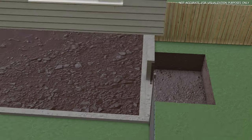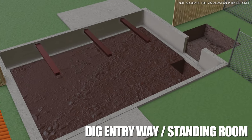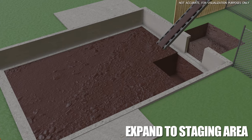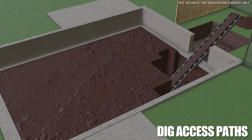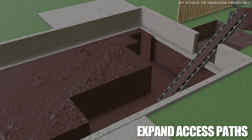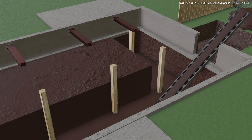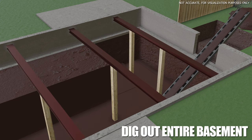Once that is done we're going to make our way inside. The beams are removed for visualization purposes. We're going to dig our standing room, expand it to a staging area, and dig access paths — these are very crucial. Then we're going to expand these access paths where we're going to erect our temporary support beams in crucial locations so they support the weight of the house.